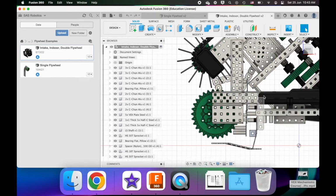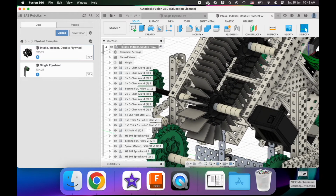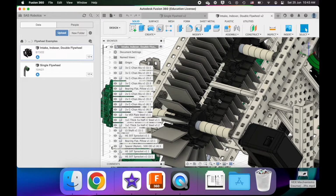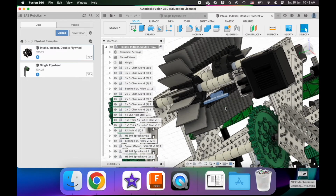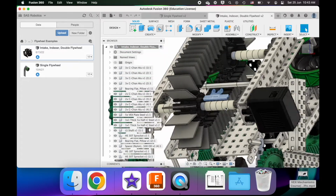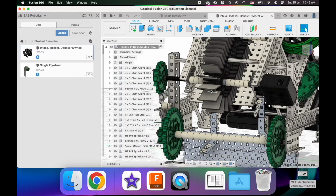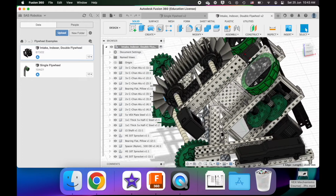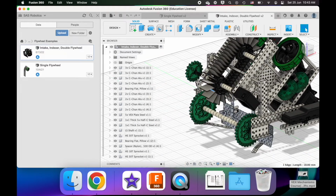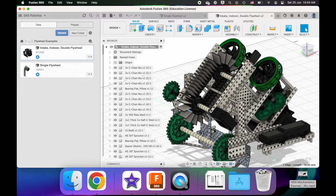And then now we've moved on to the indexer section of the robot. The indexer section usually is run with some kind of chain, usually chain with tank tread, well, yeah, with conveyor belt links so that you can put these flaps onto them, and this allows you to push the game piece along in the robot, because usually you don't just have an intake that feeds directly into an indexer, because let's say you're driving around the robot, right?